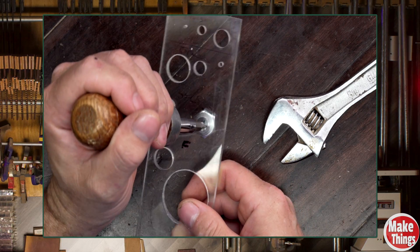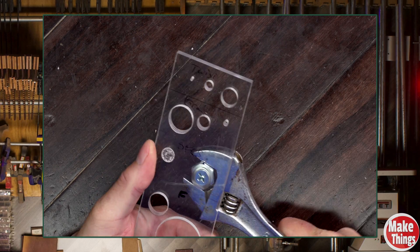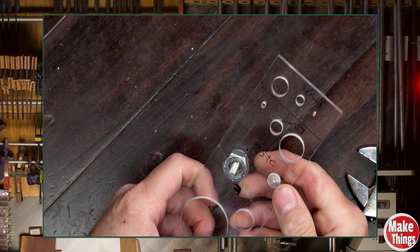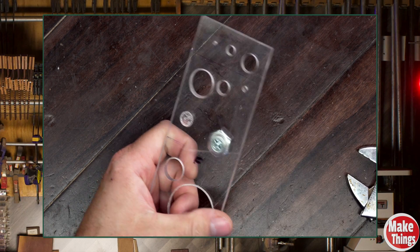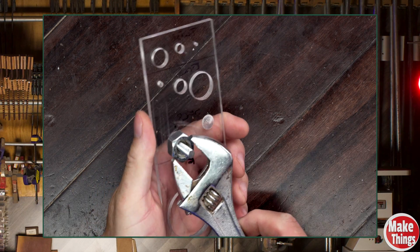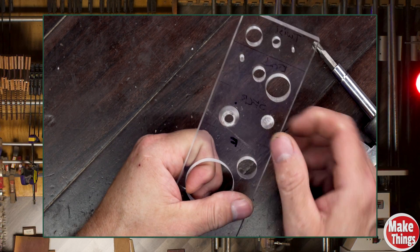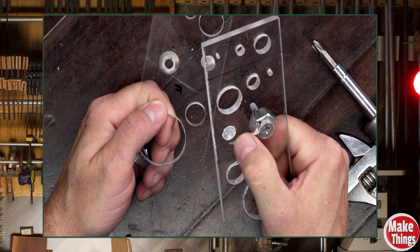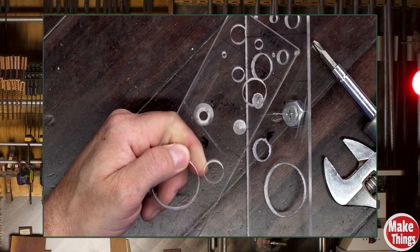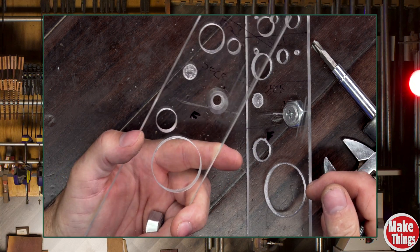Now let's see how the cast does. I keep twisting — that's one full rotation, then two — moving the point all the way around just like the extruded, and you can see there are no cracks. I keep going. At this point I just give up and look at the underside. I've spun it all the way around once. Instead of cracking the plastic, it actually started just pulling through. That is a huge difference — it shows you have a better chance of pulling the screw through than actually cracking the cast acrylic.